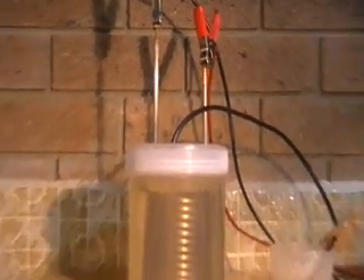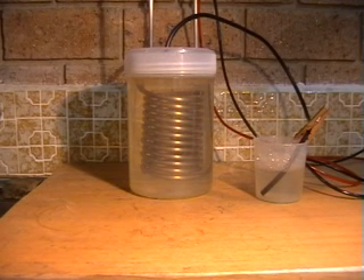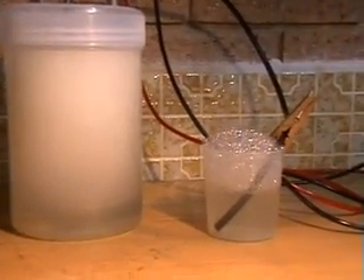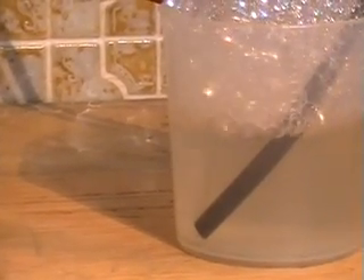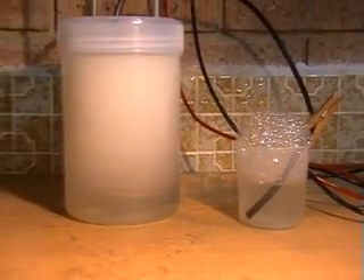We connect the terminal ends to the copper, not the stainless steel. We'll just turn it on and I'll bring it up to about 25 percent duty cycle. I'll try and show you the magnetic effect, then I'll turn it up to about 90 where it clouds. It's sort of hard to see, but you definitely get an increased effect of magnetism due to the copper inside. The production from these cells always seems to be quite good, and we've run them for quite long periods of time — the heat produced is quite minimal if the frequency and electrolyte are set right.